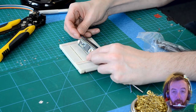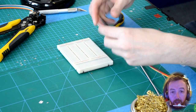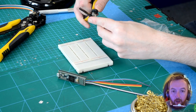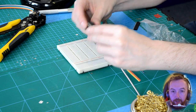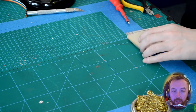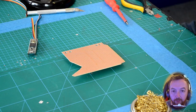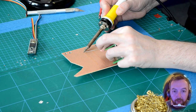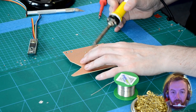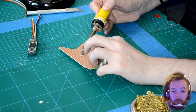Now we're going to do the female headers. We cut the female headers to the same size and then they get soldered onto the PCB. This means we can put the Teensy on and take it off whenever we need to while we're working on it. It's also good for testing, because you'll always get some feedback from the Teensy when trying to check for shorts and good connections. Again, solder the four corners first so we can straighten up the headers without having to do the whole lot.